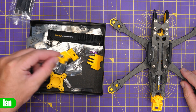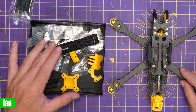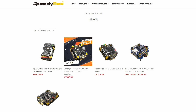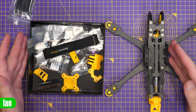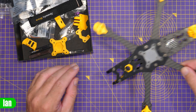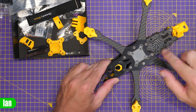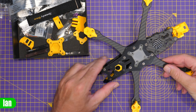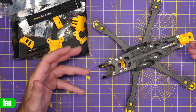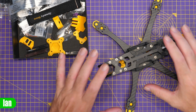These frames are designed to be used with Speedybee stacks, and they make some really nice stacks — some of the best priced stacks available on the market today. However, you're not limited to using Speedybee stacks on this frame. You can use it with any normal stack using the usual mounting pattern. You've got all the additional mounting options at the back as well. You could mount a Vista, another Air Unit, or even an Air Unit from another manufacturer if you wanted to. The frame gives you plenty of options — you're really not restricted to the O3 system or Speedybee stacks.